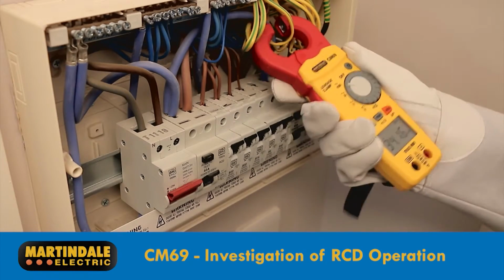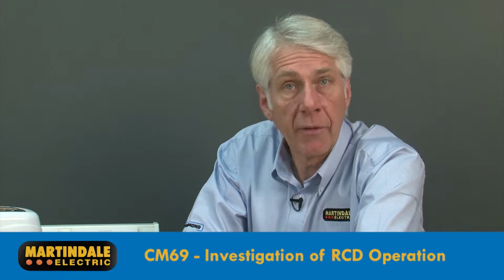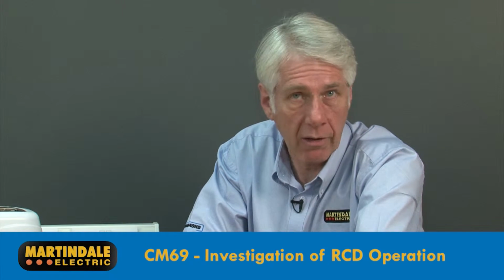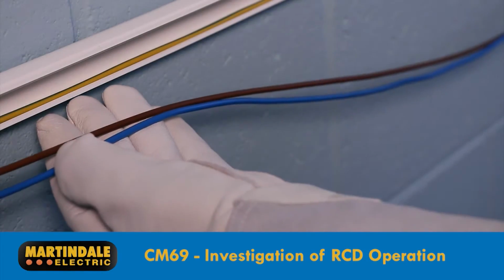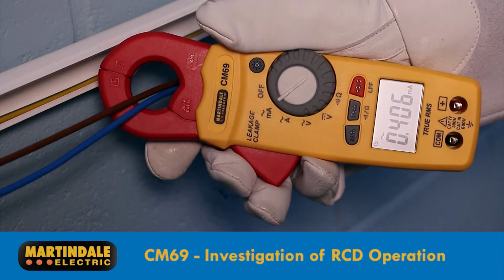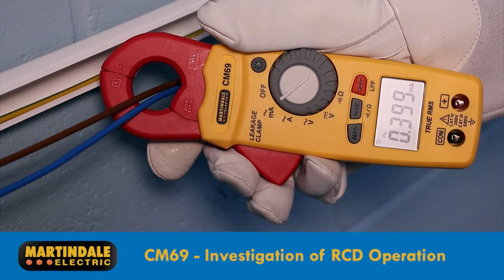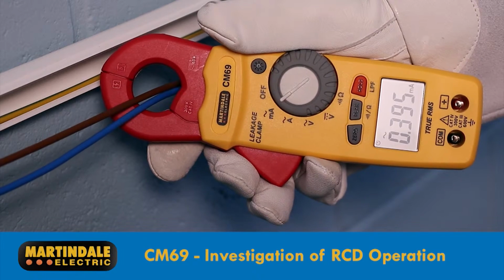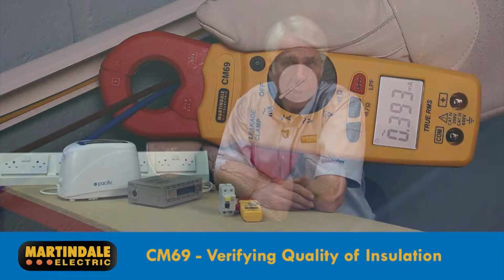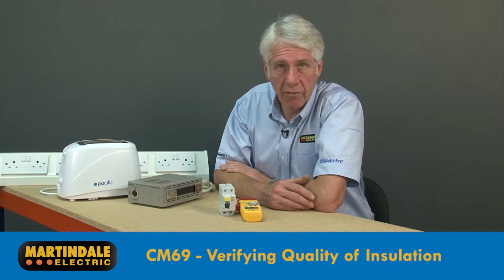The only problem with readings of protective conductor currents is that by the very nature of parallel earth paths, it's hard to guarantee that none of this current is coming from elsewhere. A better reading then can be made by clamping around the live conductors for a circuit. Any value shown is definitely the difference between what's coming in and what's going out. We can actually use this reading as an indication of the insulation resistance and integrity. So this is a great way to verify insulation resistance without having to isolate the supply.